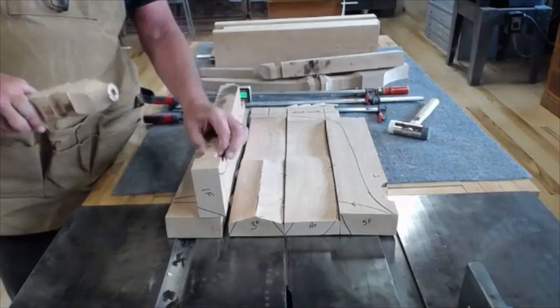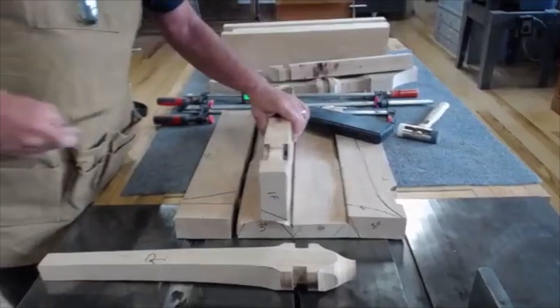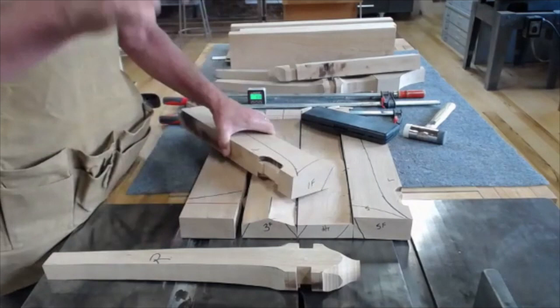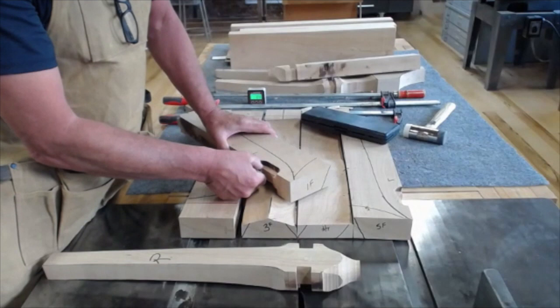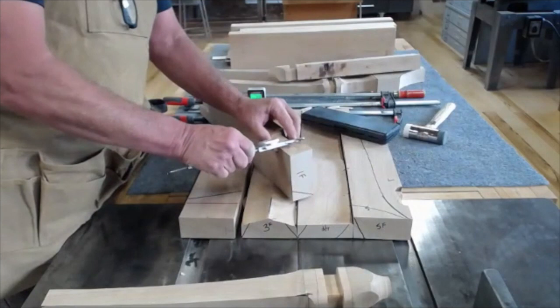So what I use is the vernier calipers. And if there's anybody out there that made one of these, you know, this is kind of a trick to make this joint. So I will cut this dado on my Hammond glider, and then on the router table, I will route this half inch slot on the top and the bottom, and then the dado on the leg is measured by this thickness, not a ruler, but by that.